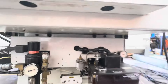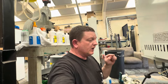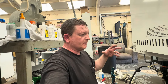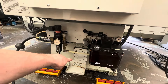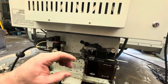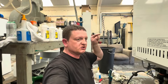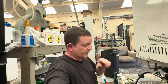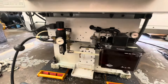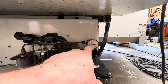That's how minimalistic the air oil system is on these spindles - there's not much, so if things go wrong and you lose that oil, that's when your spindle goes bad pretty quickly. The proper way to tell by the book is you disconnect this line and run it into a bottle. You can't do it at the spindle end easily unless you take the tool release piston assembly off. If you just want to make sure the main end is doing what it should, you can disconnect it here and run a line into a bottle and see if you get some drops of oil. We've got pressure here but I don't think that's actually going down - I think it's built up pressure and is now staying there.